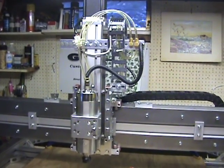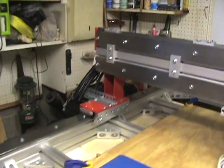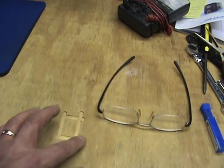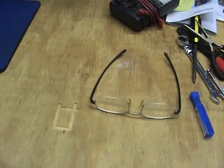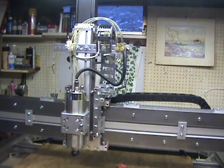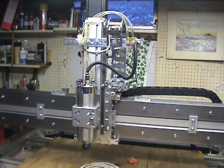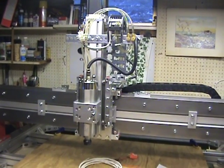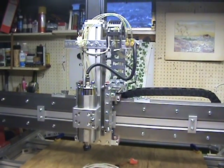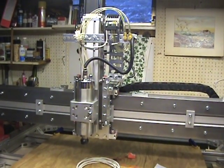Everything's functioning. I just have to get it tied into the breakout board to be controlled from the software, and from there we'll pretty much be ready to start making some cuts. I did manually jog a few slots with an end mill just playing around — it cuts well. I still have to attach some limit switches. I'm going to use cherry switches initially, with stops at both ends of the axes. I'm also looking at getting some hall effect switches for actual home positions for more accuracy. After that I have to work on setting things up for the dust collection, which I'll cover in the next video.